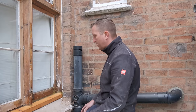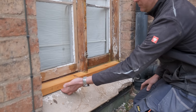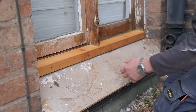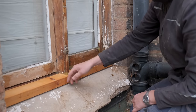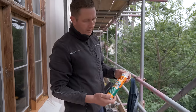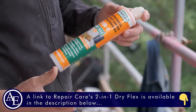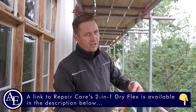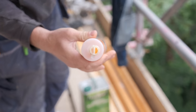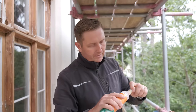That's a proper job — it's all been treated so it shouldn't come back. There's a drip mould machined underneath there so when the water flows down and round it can't get underneath — it just drips down where it should and doesn't come back. This is the resin we use — a two-part system. You can get them in two tubes; where I buy it on the internet is mypaintbrush.com. It's cheap enough to buy in one tube. Inside you can see the two different colours — one's the activator, one's the resin — and that's what we use to stick all this back together.